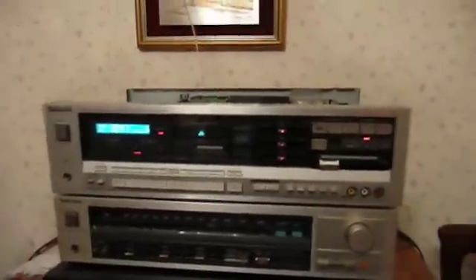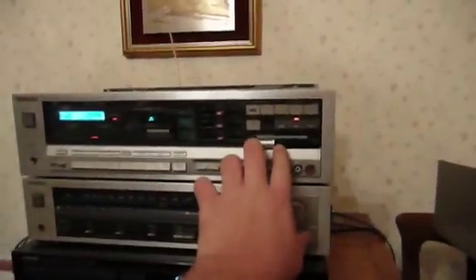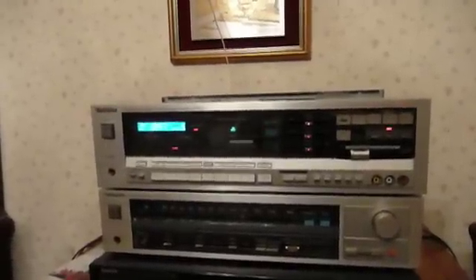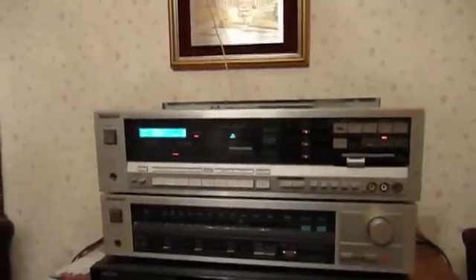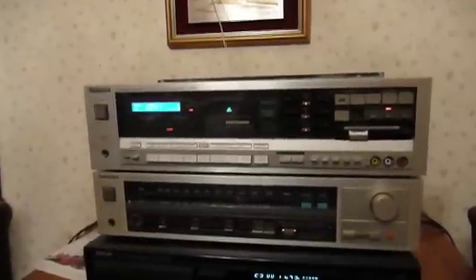I was kind of worried about inducing a hum or noise into the speakers, or causing instability in some of the electronic circuits of this receiver, but that hasn't been a problem in my test so far. The reason the relay was problematic is because it had burned contacts. The way burned contacts happen is if somebody switches the receiver on while the volume's turned up to any appreciable amount — the current crossing the relay contacts causes an arc, and although there's material deposited on the contact points to stop that from happening, eventually it gets burned through and the relay has burned spots on its contacts and doesn't work reliably. But it does work just fine now, and this receiver sounds great once again.